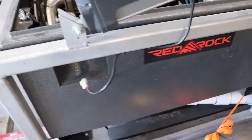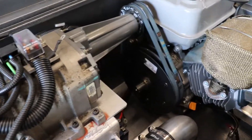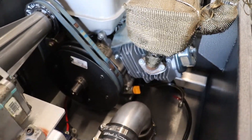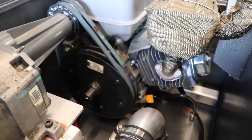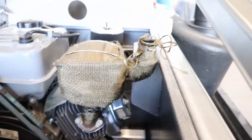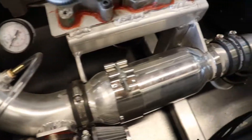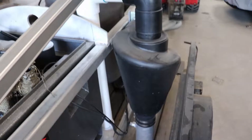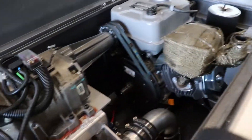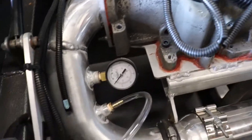In the job box, also from Princess Auto, we have our 420cc 15 horsepower motor driving that supercharger through a custom double V belt. The exhaust is shooting up there. This is an inline air filter — it's just the last line of defense so that any debris that makes it through the tank and through the cyclone doesn't take a trip through the supercharger lobes.